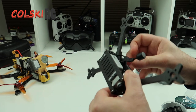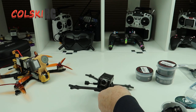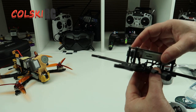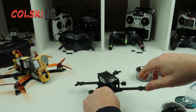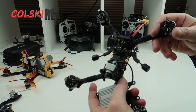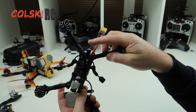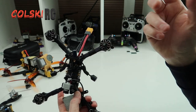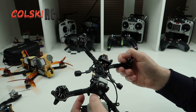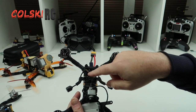As you can see the air unit's in now and it's in place. These hold in place properly when you put your stack on - the stack mounts onto the top. So I'm going to take it away, put the motors on, and solder up the wires onto the ESC. As you can see, I've got the ESC mounted. You have to bring your wires out the back for the bottom mount battery. The only thing I've found is I can't get the capacitor inside that frame because it's going to hit the air unit, so I've brought it out the back here just under this guard. So far very easy to do indeed, and this is a really nice board to solder onto.